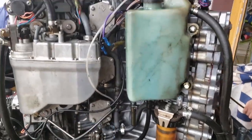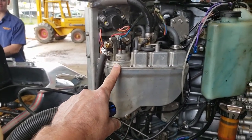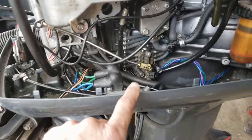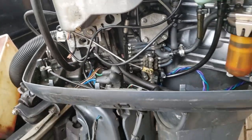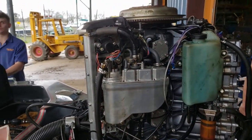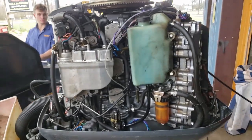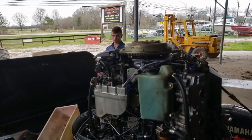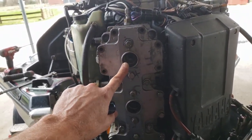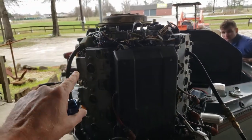We did replace the fuel pumps — this has three fuel pumps. We took the VST apart, cleaned it, cleaned the injectors, and it seemed to be functioning. We were running the oil pump on this unit and it seemed to be okay. It was a lot of work — kind of a basket case — but it ran really well. Right now Joseph and Kenneth are going to run a compression test. We're pretty much assuming number two is zero based on the damage we see in there.